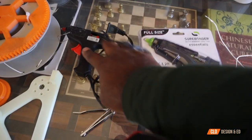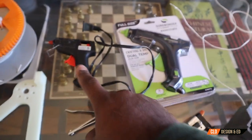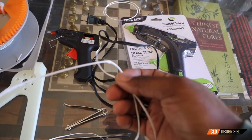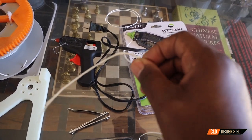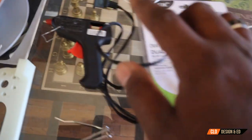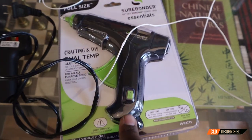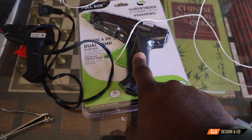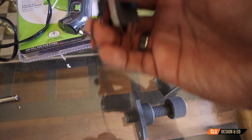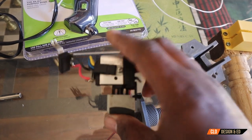When I first started off with a glue gun, the result was pretty good but it wasn't consistent on each end — because the nozzle tip was too small. So I had to pick up a bigger glue gun with high/low heat settings, which should really help. Next up you're going to need some kind of speed control. You can do this with a potentiometer, but today I'm going to use the trigger assembly from an old drill, which has its own built-in speed-ramping potentiometer.